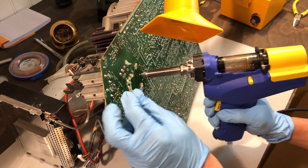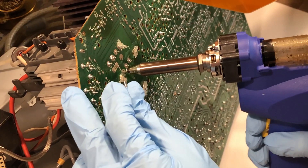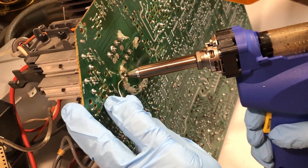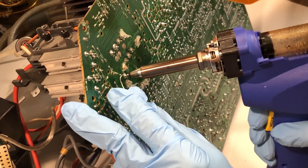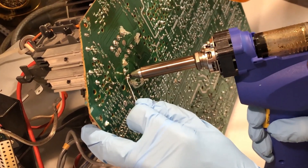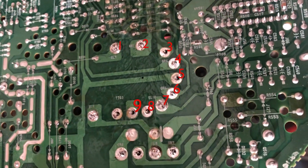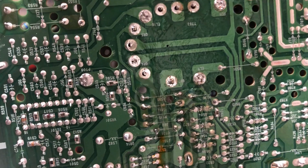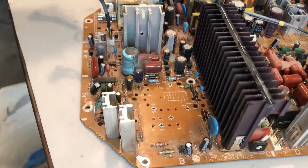Now that I finally had the board out, I finished attaching the neckboard — and oh no, I need to actually desolder the flyback. I knew I'd have to do this, but a little secret: I have no idea what I'm doing. But I'm not smart enough to listen to warning signs, so here we are. I'm trying to desolder this piece of junk and it's not going well. If you desolder a capacitor, that's two pins to desolder. This flyback has 15 pins, and it's really hard to remove all the solder from each pin. There might be some tiny bit of solder still stuck inside a couple of the holes, and the whole thing just doesn't budge. After many tries, I finally was able to desolder enough pins and pry off the flyback.